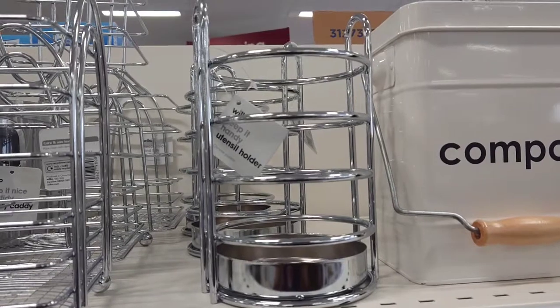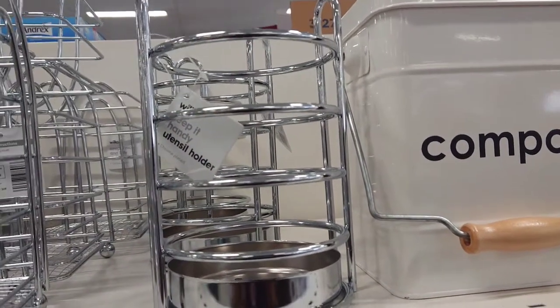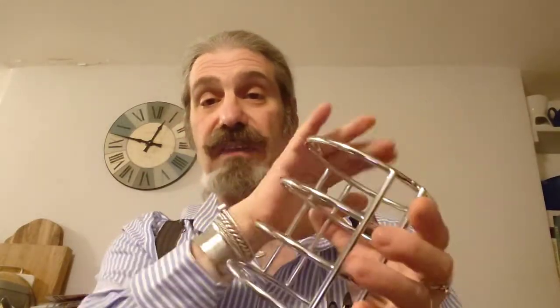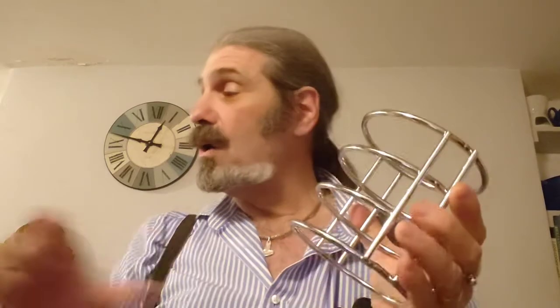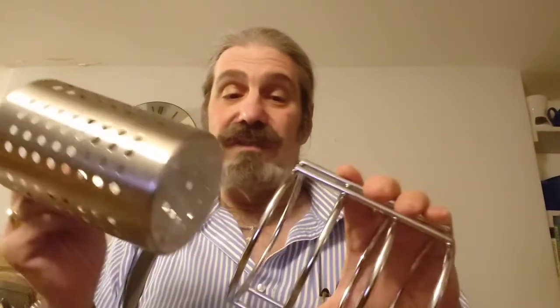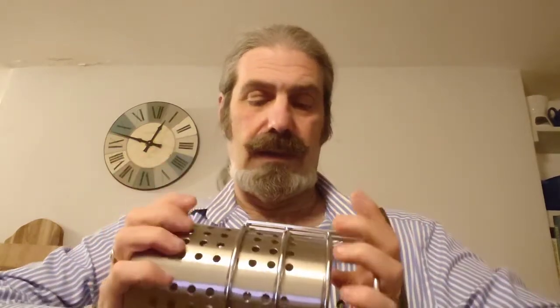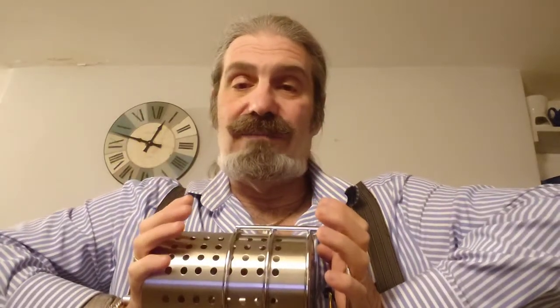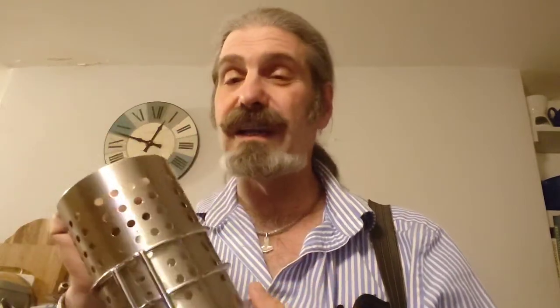The center section is cut off easily with an angle grinder or hacksaw, then the sharp edges are smoothed down with a file. That's component number two. Having taken the base and top off, we're left with the center section from the second piece. The two components actually fit together — it's slightly tapered so when you push it in it locks, and pushed in as hard as possible it's pretty firm. We're about to make it a little bit firmer.